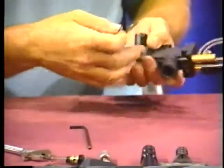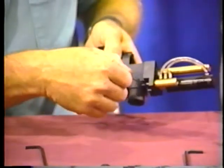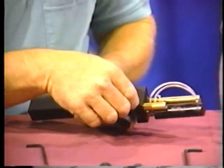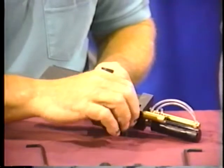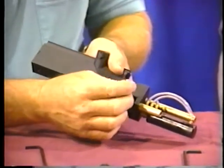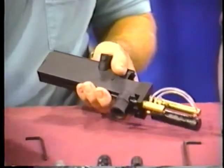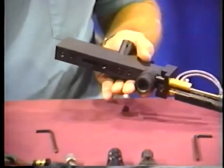You do this by removing one set screw, the one on the rod itself. A lot of times, when you get your small Allen wrenches, don't use a ball end to loosen it. We just snug it up and use a 90-degree angle one to tighten it, because you will snap the heads of them off. Don't lose that little Allen. Pull the three-way actuating rod out.